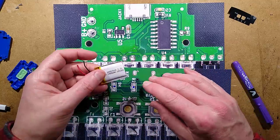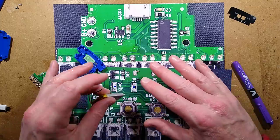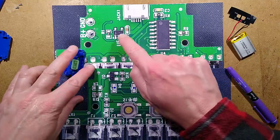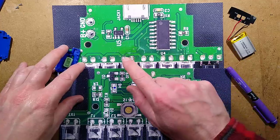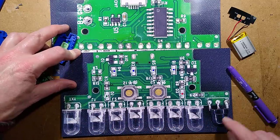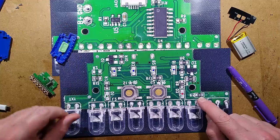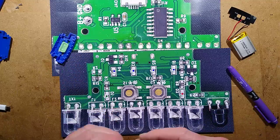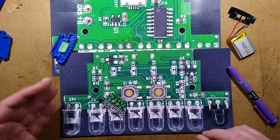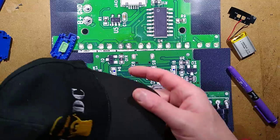Other sellers are advertising 600 and 800 milliamp-hour options at different price points. The label had a number on it but I couldn't find that number when I searched eBay. So, to summarise: a dedicated microcontroller programmed to the task, the TP4054 charge chip, two transistors driving the infrared LED and six output LEDs, and an independently switched infrared receiver with that mysterious 10 ohm resistor on one of its inputs. That's more or less it — it's pretty good, I quite like it.